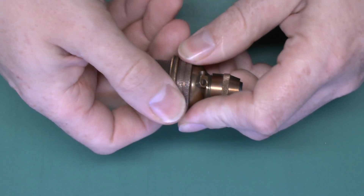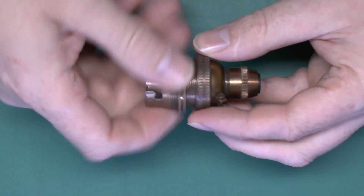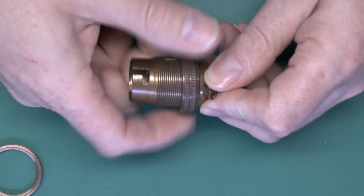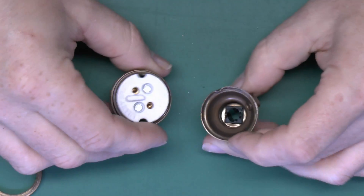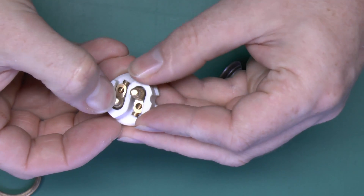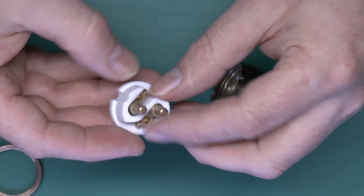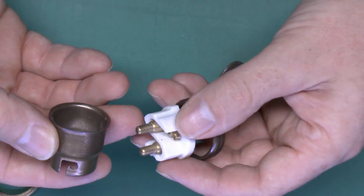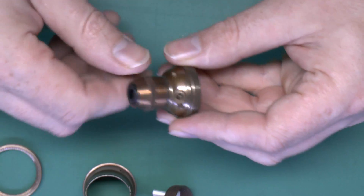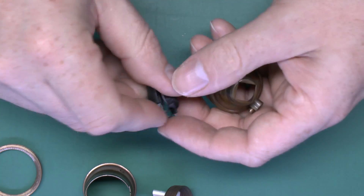These things are fairly cheaply available — these ones are actually made in the UK. This ring is normally for the shade, which fits over and clamps in place, but in this case they don't have a separate shade, so we can remove that part. This ring here just unscrews. Inside we can see the top part, and then this ring secures it. Inside we have the actual holder with two brass sprung pins, the terminals, and entry holes for the two wires on the back. This is all made of ceramic, designed to operate at high temperatures. The base has a side terminal for the earth connection on the outside and a threaded piece, and inside there is a black plastic piece that grips the cable to hold it in place.